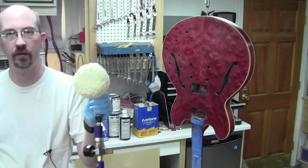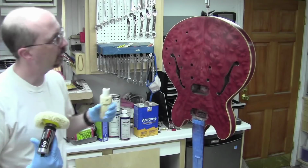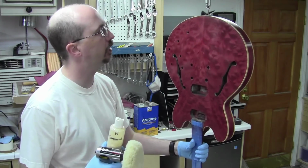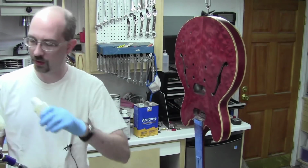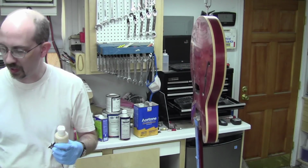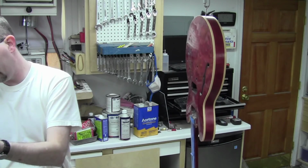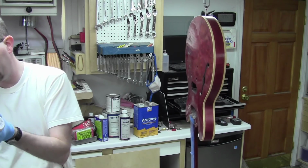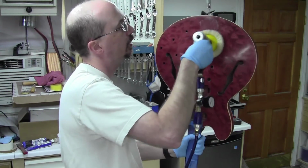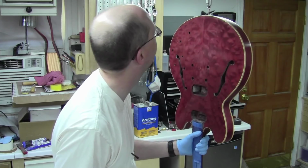So we've got a brand new pad, completely new. I'm going to do some of the 84, because now that I can see there's some polish on here, I can see where the deeper scratches are. So we're going to try this 84 and work those out. I'm going to try to prime this thing first. And as I learned on the 83, we do not need a great big pile of it. We don't need much at all. So we're just going to smudge this on. Still not pink. That's what I keep fearing, is I'm going to burn through it.